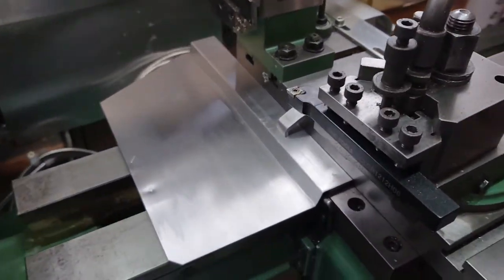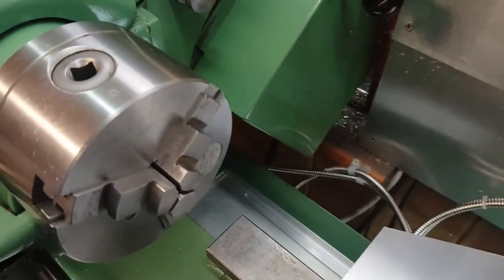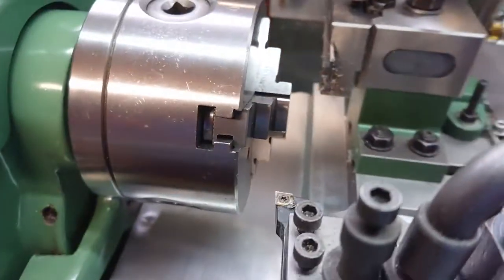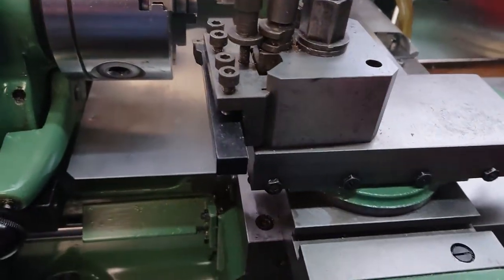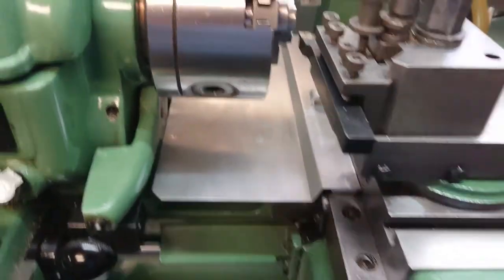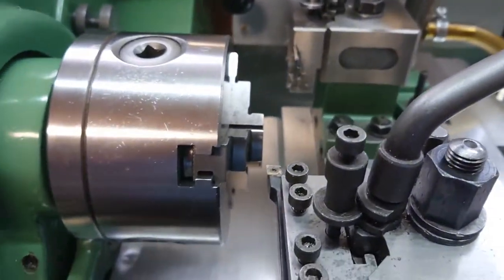So my piece is just a simple bent piece of aluminium. I've shaped it so I can get it close up to the chuck - about there - and the compound slide is probably about there. What I wanted to do is get this as close as I could and get my compound slide not hanging over too much, up to this particular chuck.